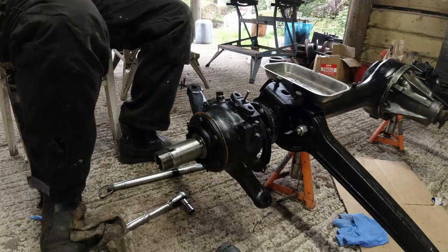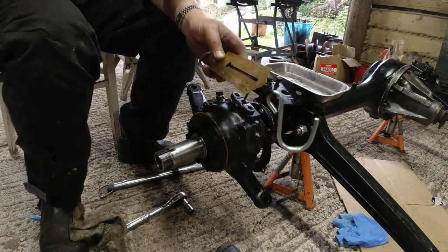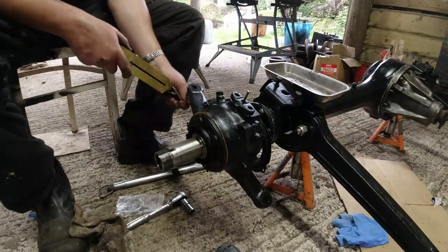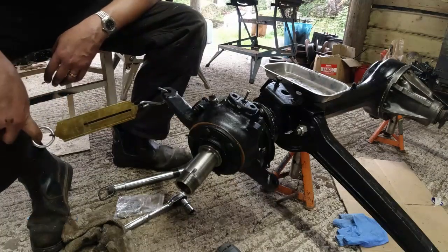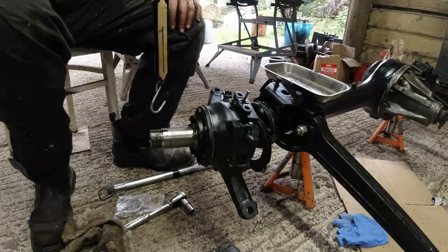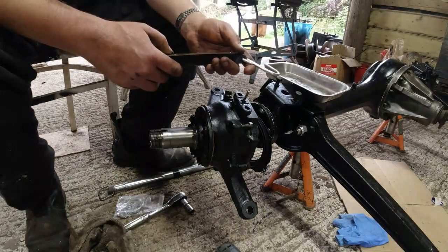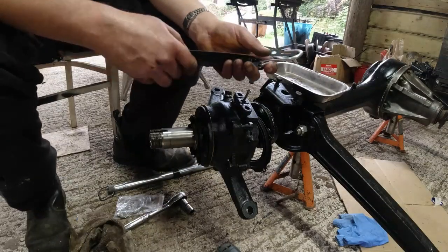What tools do you need? Not a lot actually. A couple of specialist things. Spring balance — use them for just about everything, really useful. Effectively what you're looking to do here is to exert, I think it's two to three pounds of force when you swivel. That's the main thing — 2.5 to three pounds. We haven't got a really fine scale on this one, but I've got two and four so I'll work halfway between the two and four scale.